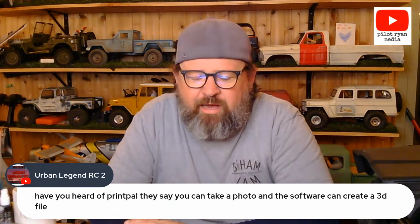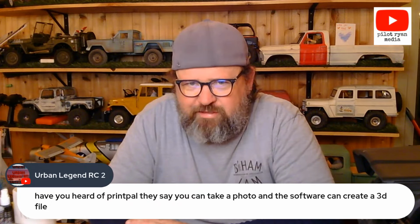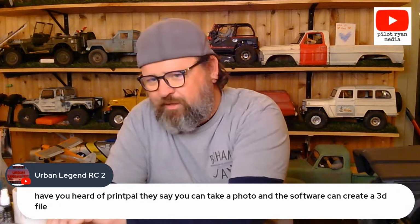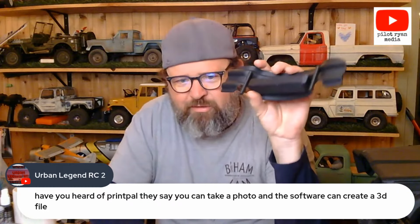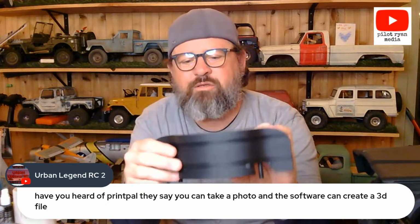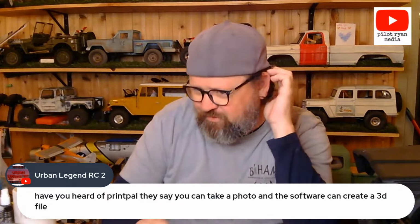Yeah, Joey, I'd like to try that because I'm using calipers and getting close, and giving a little tolerance, because I know it's not going to be perfect, and you want it to fit, not fit once and be so tight. So, yeah, those pins, they're not really structural on this, but more of an alignment thing. But it was so nice to have it aligned perfect, and then drill those holes, because that's what's doing the work, really, is this rectangle. And man, you break it, you can glue it or print another one. It's awesome.